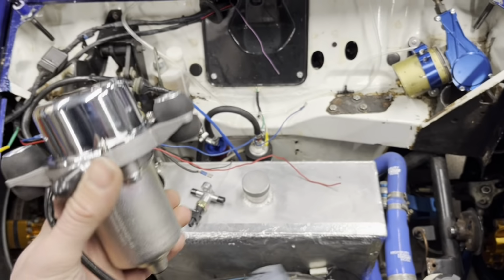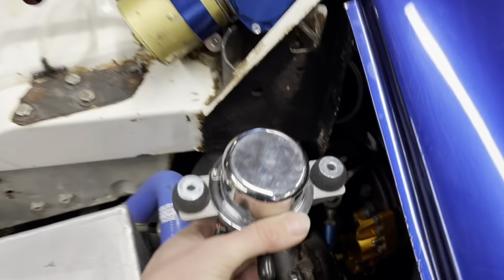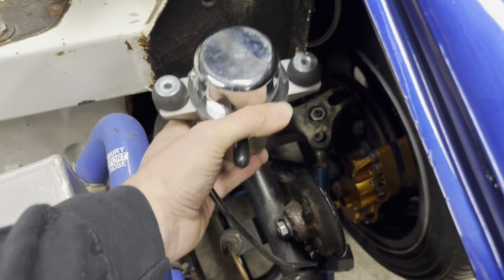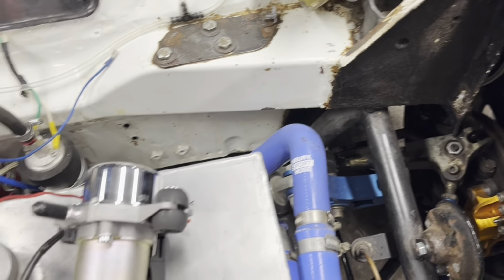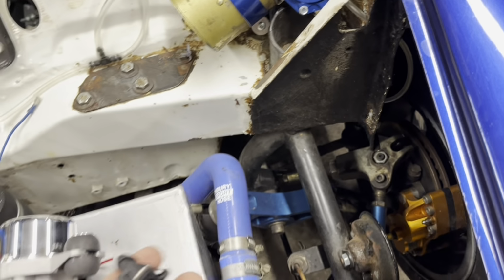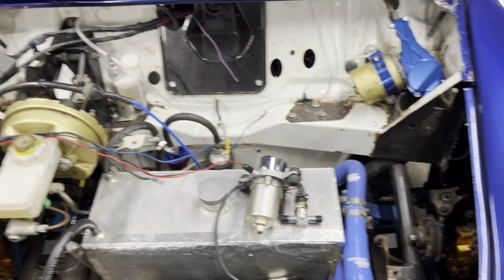Right then, looking at this, there aren't a lot of places you can put it under here, because I don't want it up here because it might create vibration. You need it solid, and the only place I can really think of is this corner here. So what we're going to have to do is clean all this off. This is like some tar stuff. Fabricate a bracket for this, yeah? And then this can also go on the bracket. These have to be really well earthed for the switch to work. If it's not earthed, it won't work. So yeah, we need to fabricate some sort of bracket for these, like what my mate made. We'll take the front end back off, clean all this back. All right, then let's start making up a little bracket, shall we?